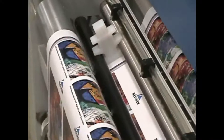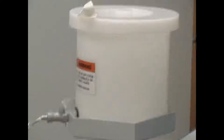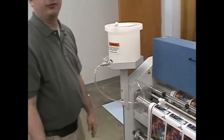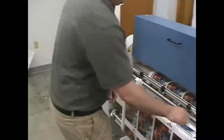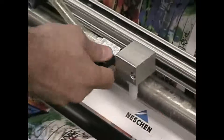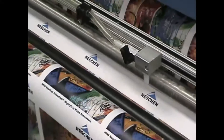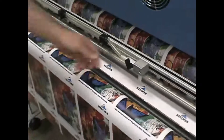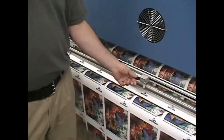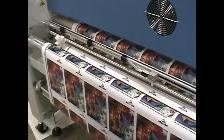You would have your coating in the five-gallon or three-gallon pail ready to run. It's enclosed so you can leave this in all the time as long as you get the top on — no air will get in. Just mix it before you run it to get a good mix. Take off the little cap on the valve and open up the valve to allow coating to run through the tubing and out onto the material. Once you get your amount of coating on there, you can either close and open it as you go, or find a spot where it just dribbles to keep the flow and maintain the amount of coating in the trough.